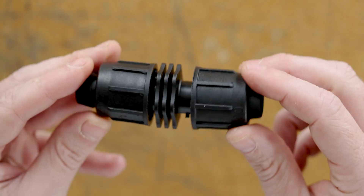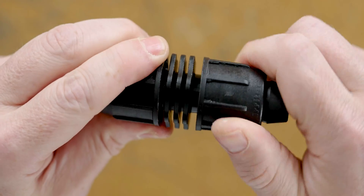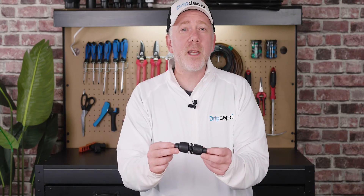Permalock fittings have taken the lessons learned from the other types of fittings and applied them into one easy-to-use fitting. Unlike compression fittings, they are completely reusable. And unlike barbed insert fittings, no additional parts or purchases are necessary to use them leak-free. They have a barb compatible with a range of sizes, and they have a handy locking nut on the end — you simply turn it down to secure it over the tubing. The locking nut does mean that, to some degree, the outside diameter of your tubing also matters, like it does with a compression fitting.